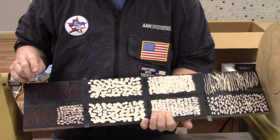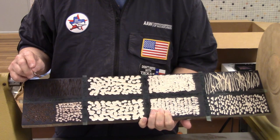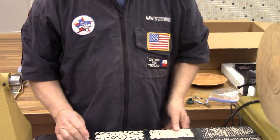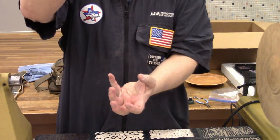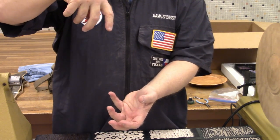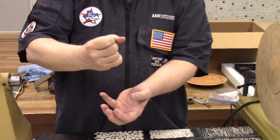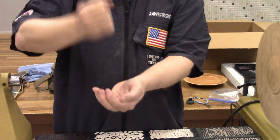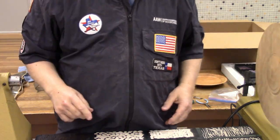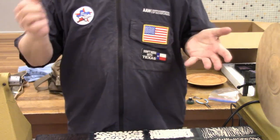How do you powder your turquoise? I wish I had the picture. There's a bunch of plumbing bits I put together. A what? Plumbing bits. Oh. And I can't remember the exact sizes, you take one pipe with threads on both ends, you cap the bottom, you cap the top with a reducer to reduce the width, then you take that width of pipe in there with a smaller cap in it, and you can crush it without the stuff going everywhere. Then you unscrew the bottom and you use sifters, but don't tell your wife you're taking her sifters. Get your own. But that's how you build a crusher.